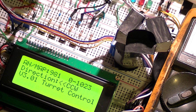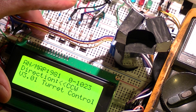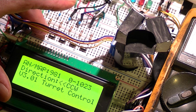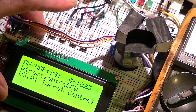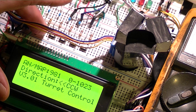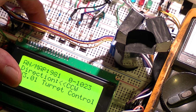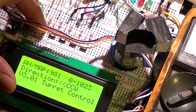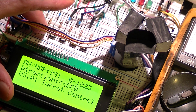This allows a more optimized way to map the analog read from the 10K trimmer pot. And so what happens now is each coil that controls clockwise and counterclockwise movement is controlled through a delay function that's directly correlated with the mapping analog function of the trimmer pot. And so it's controlled with two push buttons, switch 1 and switch 2.